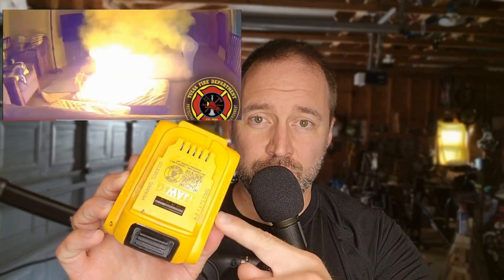Each of the cells in this battery is outfitted with a CID. That trips like a circuit breaker or fuse if there is excessive pressure, high temperatures, high discharge, an internal short — anything that can compromise the integrity of the battery — and it basically trips to prevent that from carrying any further. If the CID were to not trip, the battery could enter into what we call thermal runaway.